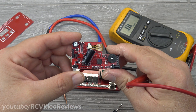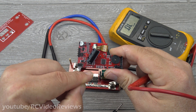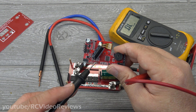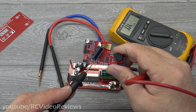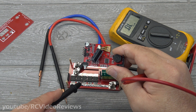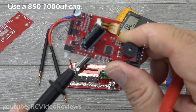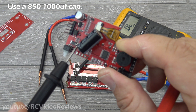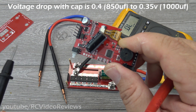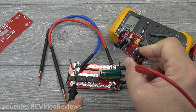One last mod I found on YouTube — I'll post a link to the video in the description — is to add a capacitor between the diode and ground. The reason is that when current flows, if your battery voltage is too low, you can undervolt the control circuit. That causes the MOSFETs to not fully saturate during the trigger and they wind up blowing and causing a fire. By adding this capacitor with the negative lead there and the positive lead on the diode, it keeps the control circuit voltage high during the discharge. It must be a known issue because my kit came with two spare MOSFETs.